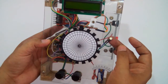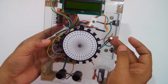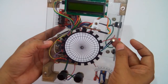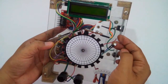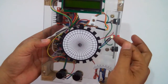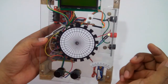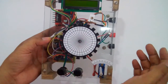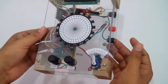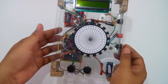The RPM can be quite high — 2,000 to 10,000 RPM — so if we blink the LED that fast, it won't be identifiable by the naked eye and will look like it's always on. So I've reduced the blink rate so it simply indicates whether the spark speed is high or low. Now I'll give you a small practical demo of how it is working.